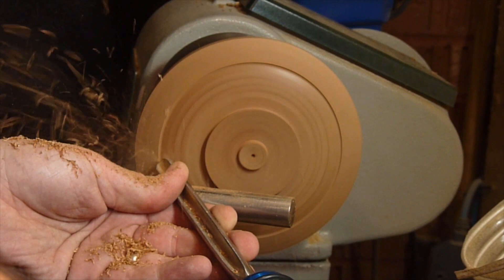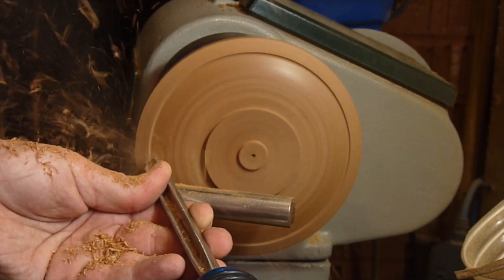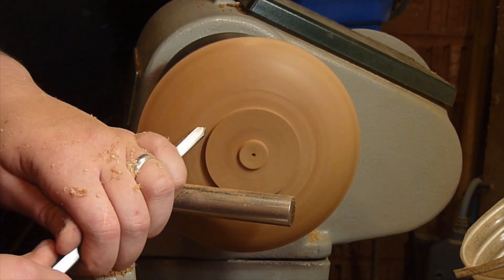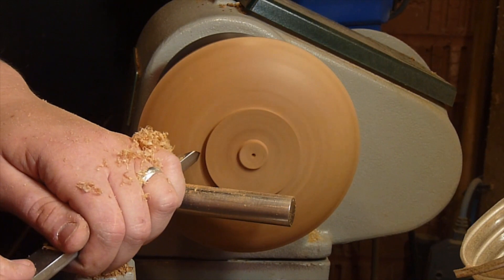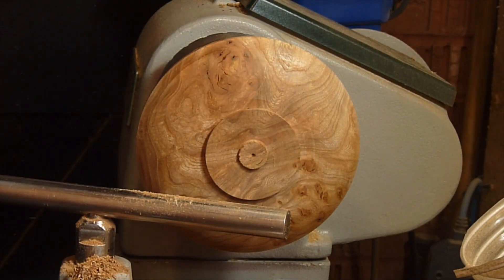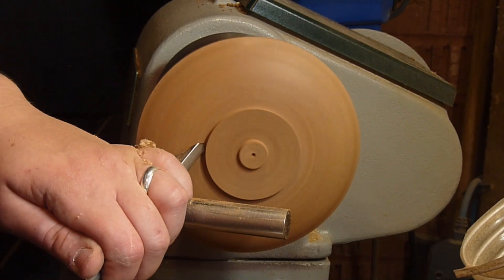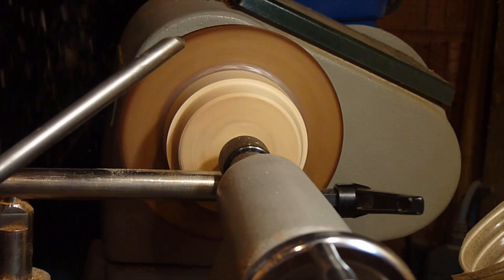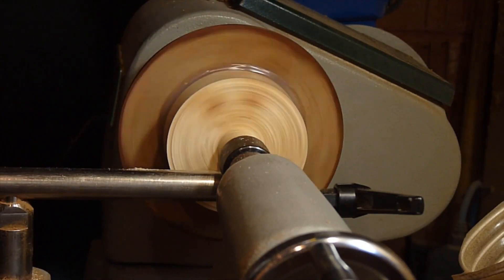...which I think — don't quote me — is about 59 or 69 millimeters width, and that'll give you an absolutely brilliant hold. As you can see, another slow motion clip. Cleaning up now with my negative rake shear scraper. The negative rake is basically a normal scraper with an angle on the top and bottom. For someone like me who isn't very experienced, rather than constantly taking lots of wood away with the push cut, just take a little bit with the negative rake.